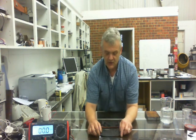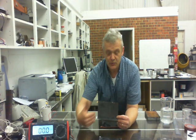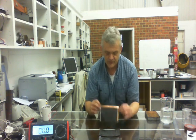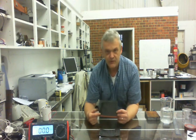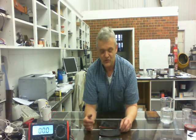So there are the electrodes, and that one has had nothing done to it - just painted on and left - that's our control. Here we have our electrodes at the top and the field lines running between the electrodes. The final one has the electrodes there with the field lines running parallel. There's a slight variation because the electrodes are at top and bottom rather than at the sides, so I should have done it differently, but we'll assume that little bit of error is insignificant.